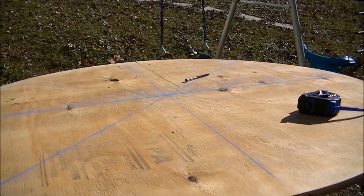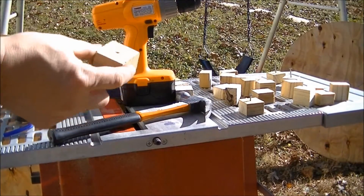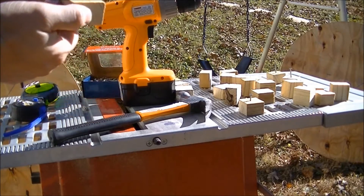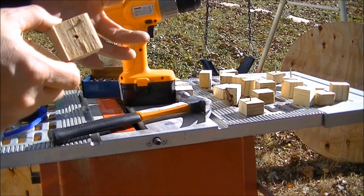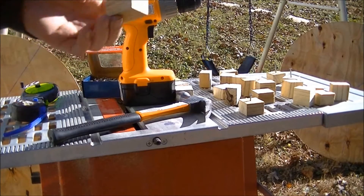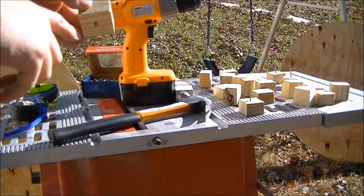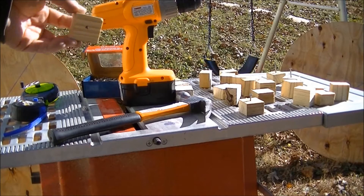I'll do my other board the same way. Looks like I'm going to have to pre-drill my little blocks before I put nails in them, because being that small, a tiny nail will bust it. So I'll go ahead and drill it instead of nailing — that's okay because it's going to nail into that board. Now put some glue on it and hold it.